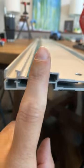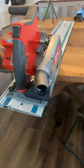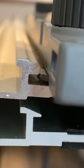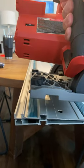Let's see if the Milwaukee will work on this. Here's the Milwaukee on a Makita guide rail, and here's what you should know if you ever plan on using the anti-tip feature. It does have a flange, but the flange doesn't stick out far enough — unlike the Milwaukee track — which means your track saw can come off.